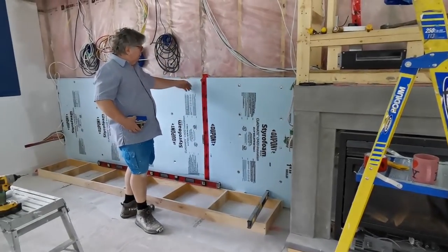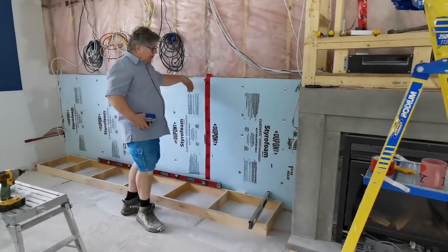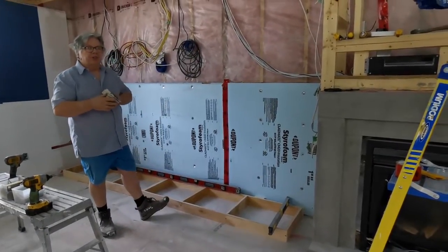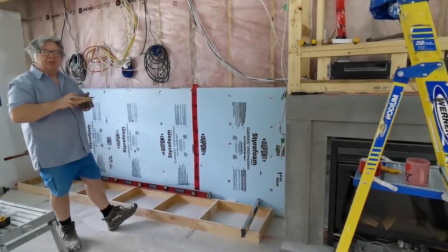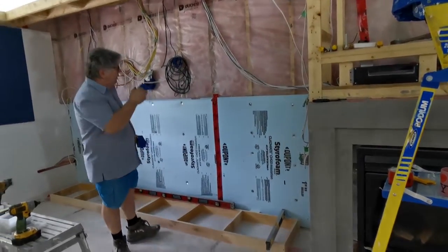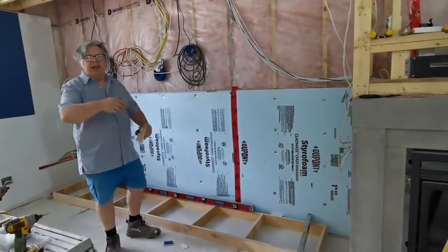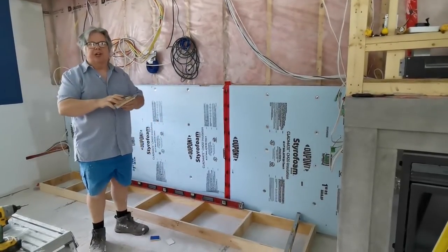So I didn't put drywall. We put this here to stop any moisture. What I was afraid of, putting it back here with all the moisture and everything else, is that the drywall was just going to turn into sawdust, because it'd be a different temperature back there, or just turn into mush. So if you see that, and you get comments about, well, what happens if there's a fire, by the time the cabinets burn, or the other thing burned, if you're not out of the house, you're done for anyway.